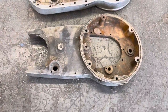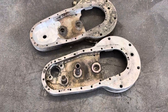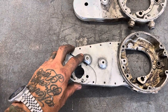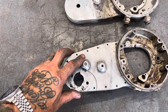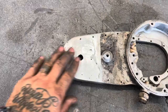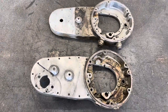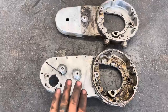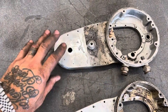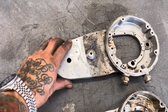When they look like this — old hundred-year-old Harley parts — you just don't throw them away. You go ahead and fix them and reuse them. On the backside of the generator case there's a threaded stud where the axle for that idler gear runs that drives the generator. On this one I've machined it off, welded it over, and hit it with the fly cutter and flattened it out. That's the difference from the generator case to the magneto case on the backside. I've got a nice flat surface here for the magneto to mate up against so you don't get any air or oil leakage between the magneto and the gear case.